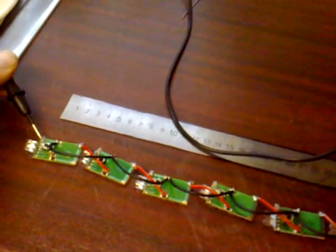That's them all soldered up now in parallel — there's a big long line of them. This is probably the most time consuming and tedious part of the whole project, but you want to do it carefully. As you're doing it, it's advisable to check with a multimeter to make sure all your connections are okay and there's no dry joints. I've put my multimeter negative lead onto the negative of this cell and the positive onto the positive of the other end — it's showing a reading of 3 volts, and they're all phased down, so that's expected.